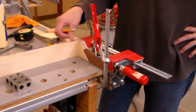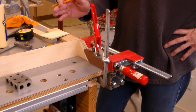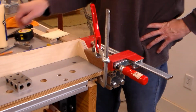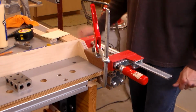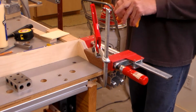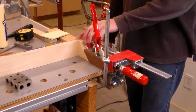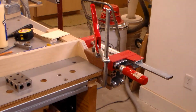And I'm going to make these, I'm going to take a piece of 4/4 and just bandsaw it in half, and then whatever thickness I end up with, that's what it'll be. Somewhere around 3/8, I suppose, or maybe a little less. But that'll be fine. 3/8, 5/16. That'll work out good. So let me get busy and start working on that.